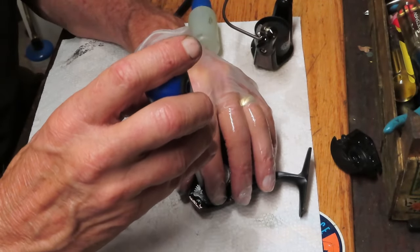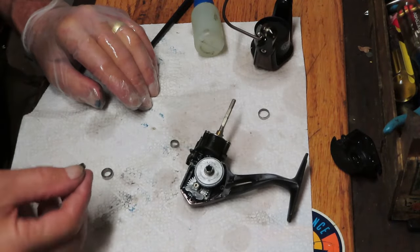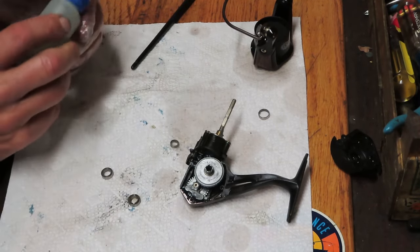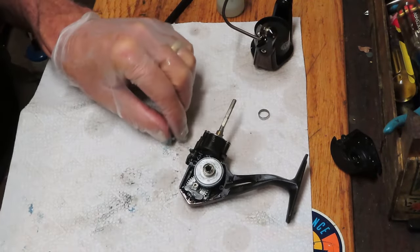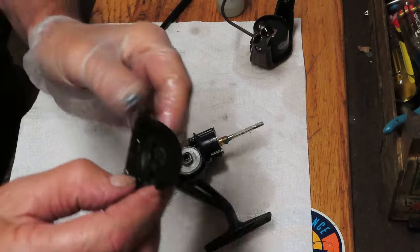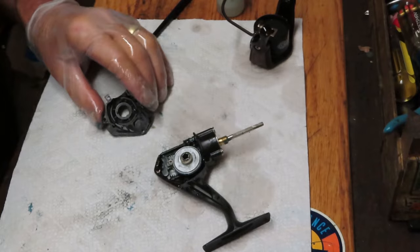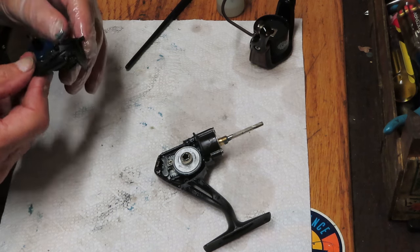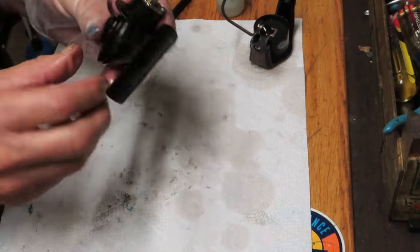Let's put the crosswind block back on with grease into the slot that goes over the stud. We can put our gear back in. For the axle shaft, put a light coat of grease on it — don't put too much on because as it comes through the pinion gear it will scrape off. There are still two more balls to remove — you can see them right in there. That clears it out — now let's put the case back on.